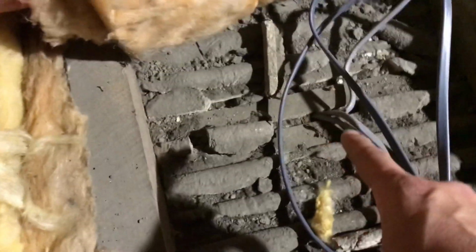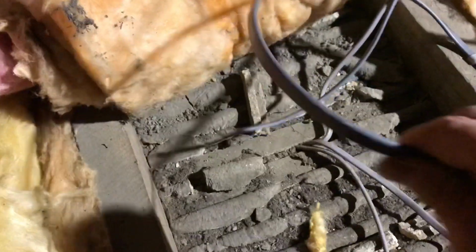This is the old switch wire that I'm going to go and rip out now. That's the light in the bathroom. This is my new 3-core that's going to drop down again. I've clipped along the beam and it will just jump over in. And this is my 2-core, which will just be a switch line and a neutral, to a socket which will be dedicated to the lighting circuit, which are going to do the new 12-volt lights down in that bathroom.